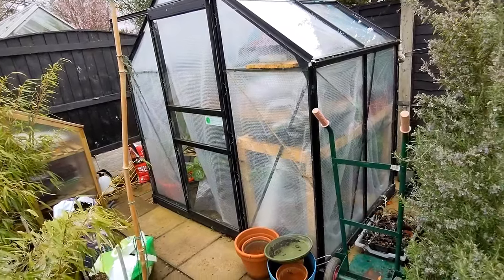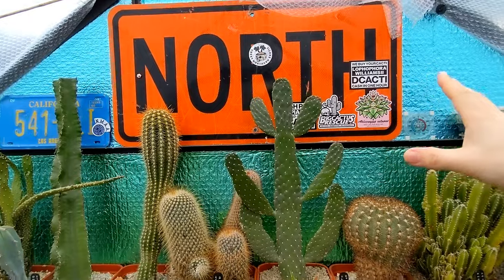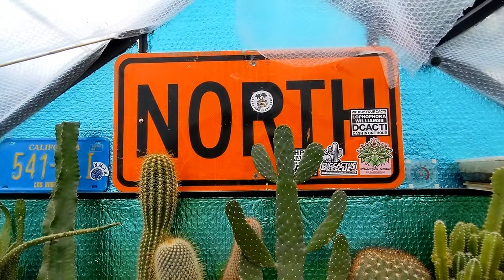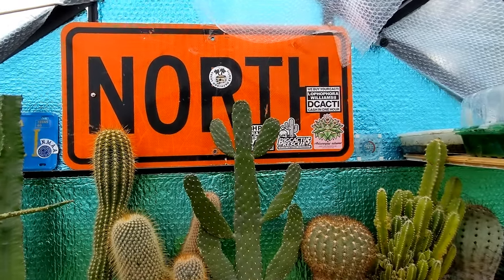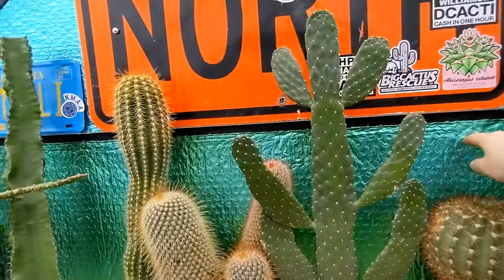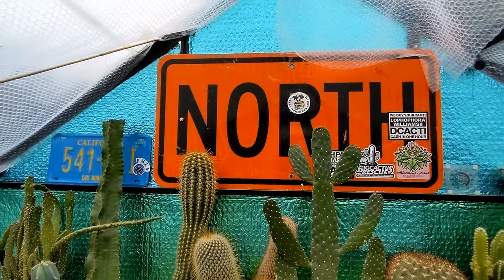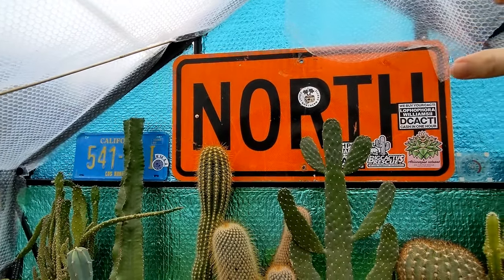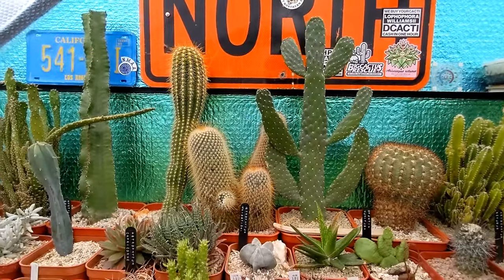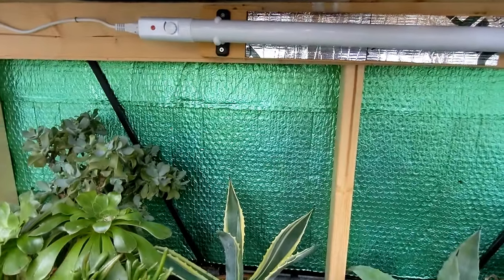So here we are inside the greenhouse. One of the first things I did was insulate the north wall with this reflective bubble wrap insulation. The best brand I found online after a little research was called Thermorap — I'll put links in the description for everything I've bought from Amazon. I bought a roll of 10 meters; it's self-adhesive on the back. The north wall provides no direct light and no heat, and it backs onto a fence anyway. I doubled up the insulation and it goes all the way down to the ground — it's permanently on there and sticks directly onto the glass.